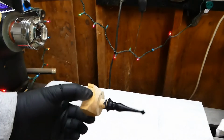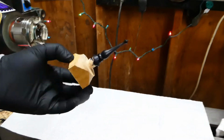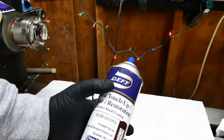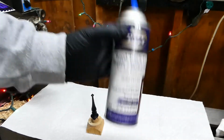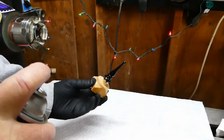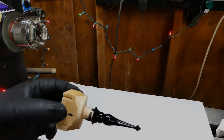All right, here's the dropper, the bottom part of the ornament. I left it on there just so I got a handle. It's already cut to size down there for the bottom of the urchin. So that's good to go. All I've got to do is spray this, let it dry, part that off, and we can start gluing it back onto the urchin. What I'm using is a product that I love. I'm not sponsored by nobody with this. It's Deft. Semi-gloss. You can sand this stuff back. Dries good, tough finish. I'm about 10 to 12 inches away on this. Just a nice finish, last coat on that.